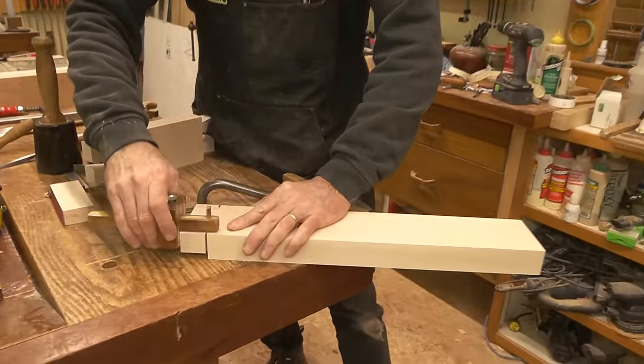In the cherry it's the same — just more laborious, but the same exact experience. Rather than chopping all this out, a Forstner bit is an incredible tool to get a lot of this waste out, and then we can come back and quickly chisel out those sockets. I've got the depth set so it's going to come just shy of our knife line.